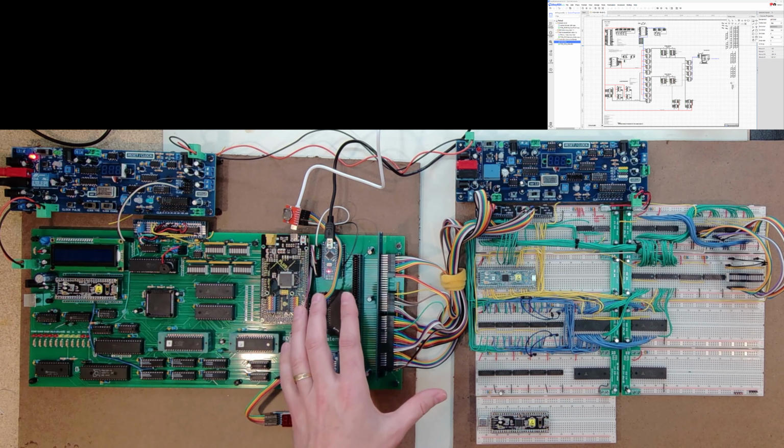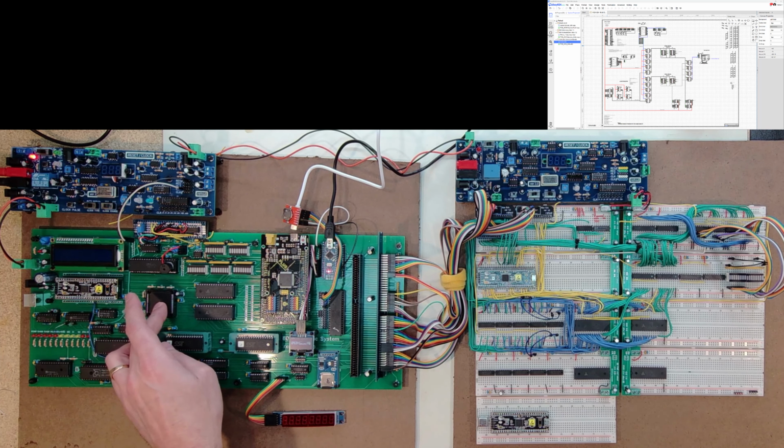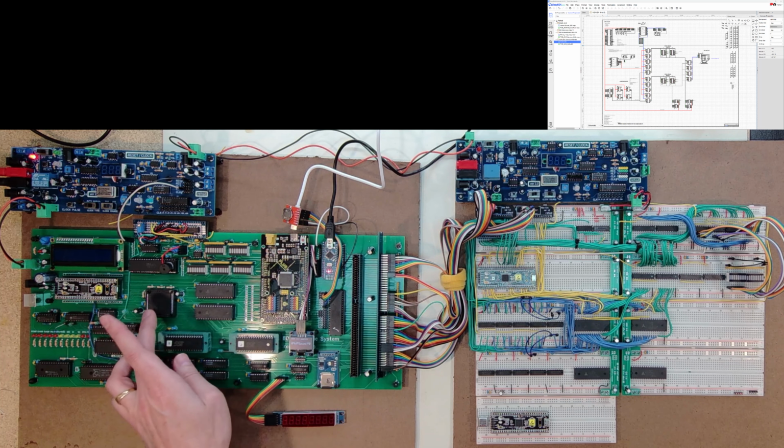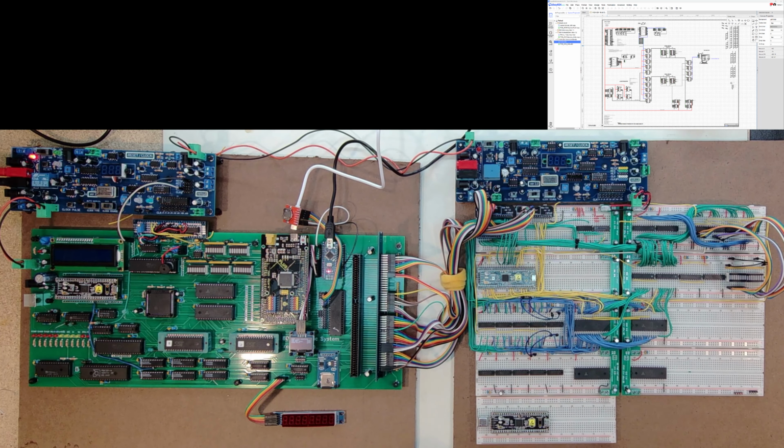I've got still this 32 megahertz. I'm bringing 16 into the board and 8 megahertz at the processor, which means I'm running 16 megahertz through all of this. And you're going to see that so far that is working. And what it came down to is this clock coming out of the clock generator.